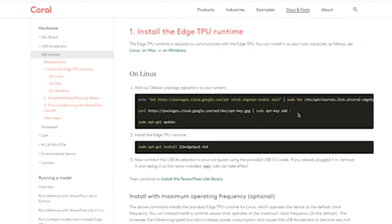The first thing we have to do — I've done a factory reset on this Pi — is install the Edge TPU runtime so that the Pi can actually recognize the Edge TPU and use it as a resource when running TensorFlow models. The instructions for this are updated based on current releases, so look at those to figure out which packages you should be installing. From there you can install the Edge TPU runtime and connect the accelerator to your Pi.